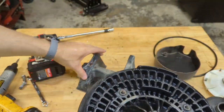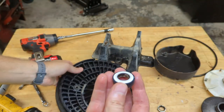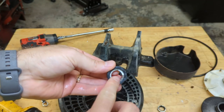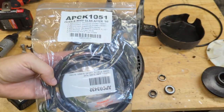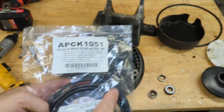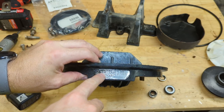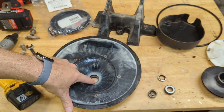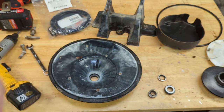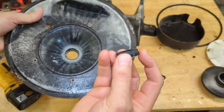I just cleaned the seal plate up a bit with a garden hose to wash the heavy stuff off. The other piece of the shaft seal just fell out — you can see it's actually chipped right there. Here is our rebuild kit, and you can see it says 1998 and after. I'm pretty sure this is a pre-1998 just by the fragments of the part number, but the pre-1998 models have a copper cone inside here and this one didn't have it. So I think we can use the 1998-and-after seal kit. I'm going to clean out this bore a little bit, because we've got to seal against that with this rubber piece.